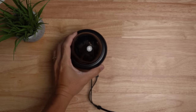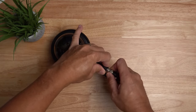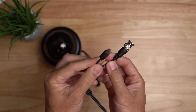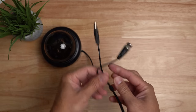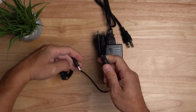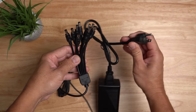If you have an older analog DVR and camera system, you already have 12-volt power wiring, which is usually paired with BNC cables used by analog cameras. You can easily replace those cameras with Wi-Fi cams that are 12-volt powered. And if you don't have any power supply, you can use a 12-volt power adapter that can power up to nine cameras with just one plug-in. I will link these products in the description below.